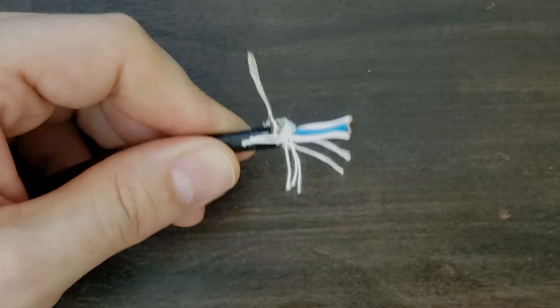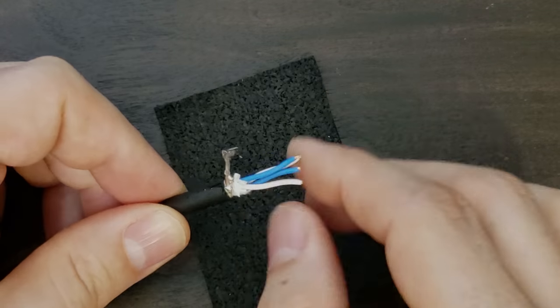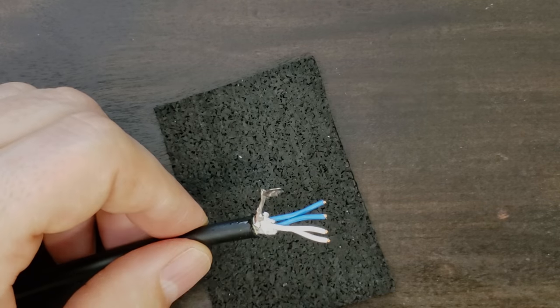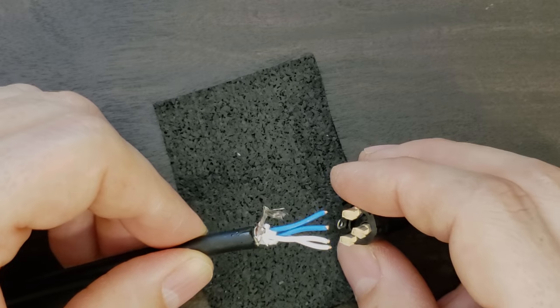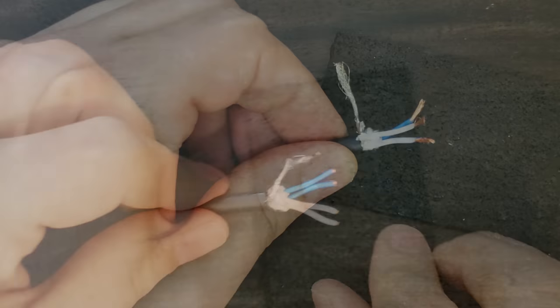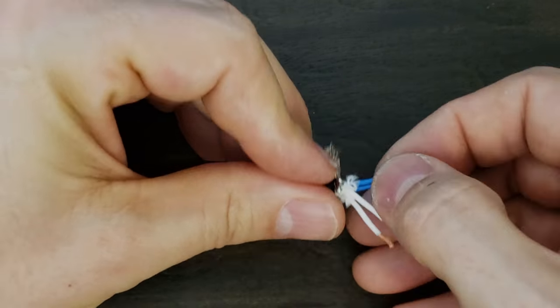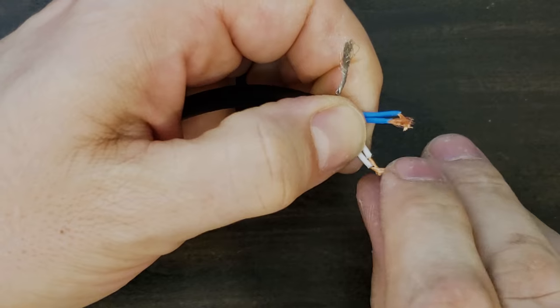Trim away the cotton string and the paper wrapping. Strip the insulation for the inner conductors. Trim enough so the conductor can fit inside the contact cups without being obtrusive. Remember, don't nick the wires as you're stripping insulation. Wires that have abrasions wear out much more quickly.